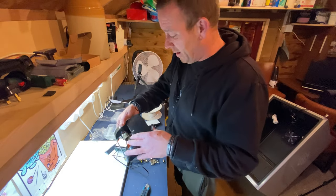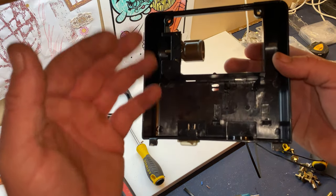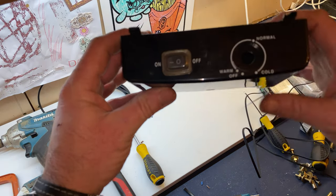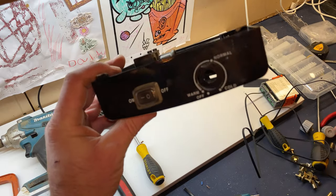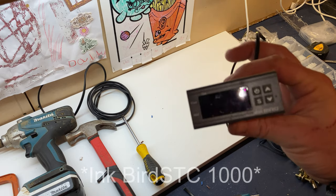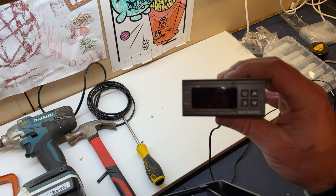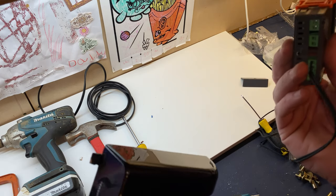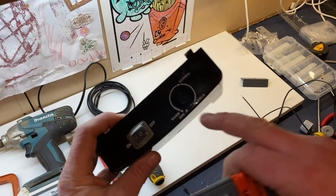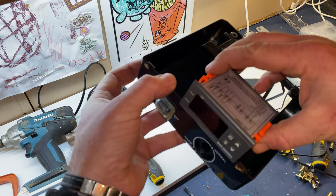I've taken the panel out but I'll still be using it. I'll keep the switch because I've got the wiring inside - so the two spade connectors will feed the light. I'm going to chop into the cables to change the control panel. My controller is this spare Inkbird STC-1000 - it was absolutely fine last season hatching. I'm going to wire it into the fridge wires, then use the Dremel tool to cut out the panel so it fits in there nicely.